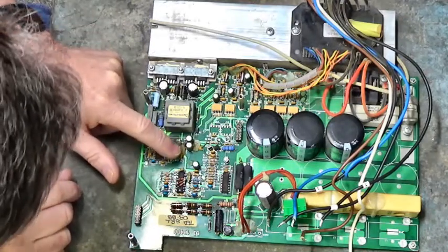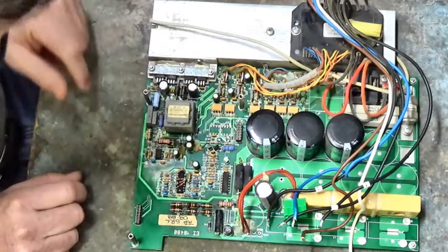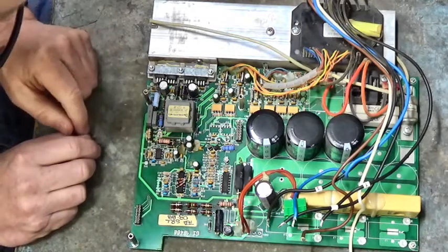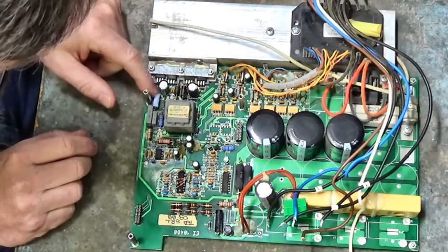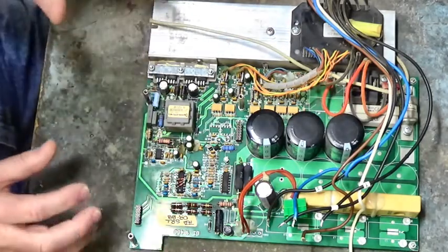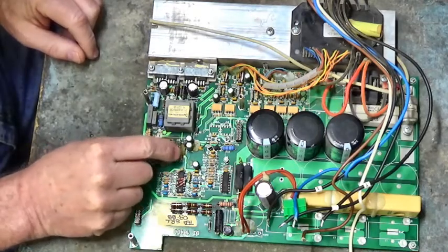Now, somebody's already replaced them at one time. These are not the factory capacitors. But I'd like to change that one right there in particular because it's closest to that. Just because this circuit self-destructed. I mean, we had to short it, the UC3844. The current sense resistor was opened up, this 100 ohm resistor between pin 6 of the switch mode power supply IC and the gate of the switching MOSFET opened up. There was a lot wrong with this circuit. Fatally wrong. I'm going to replace that.